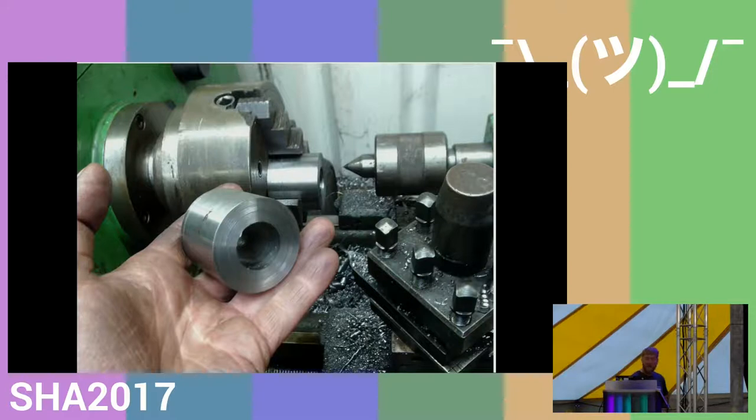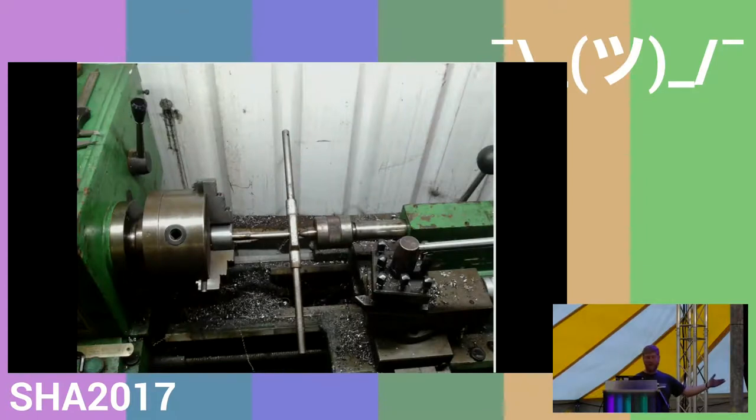Start working on the rear chassis and subframe. Because I can't use the back end of the bike, because it is no longer anywhere near anything I can modify, I have to build a new one. So I had to make the rear suspension, which involved turning some hubs and threading them, because I had to tap the right size, so I didn't bother with single point turning.